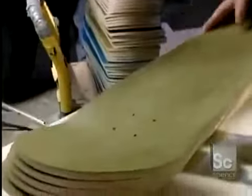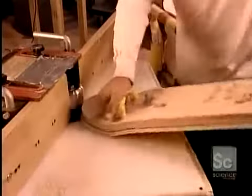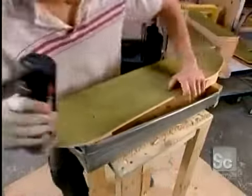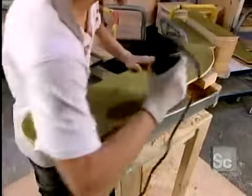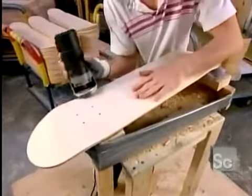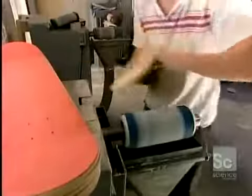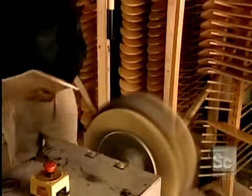Cutting off the excess separates the five decks. Now they contour each deck individually. Using a precise template, they run the deck against the cutting blade until they have the final shape. Using a router, they round off the top and bottom edges. Then they smooth all the surfaces against the drum sander, followed by a buffer which uses a combination of brushes and fine grit sandpaper to remove any rough wood fibers.